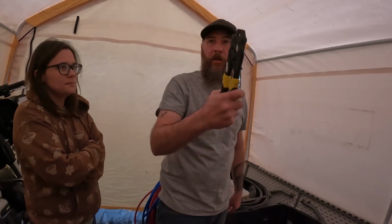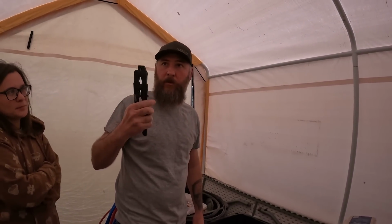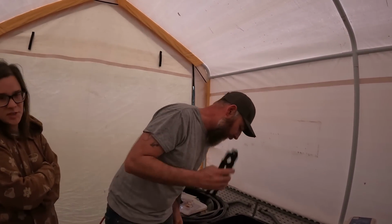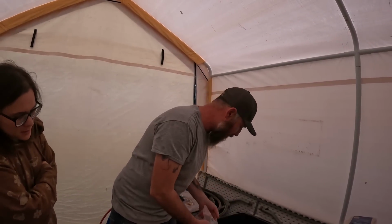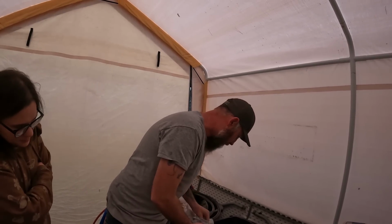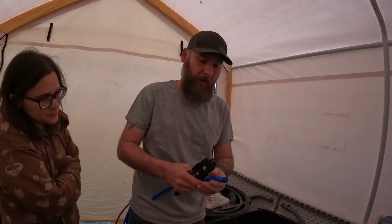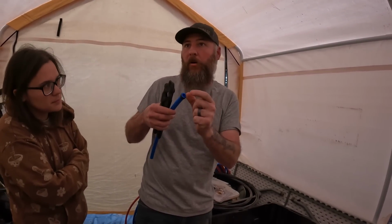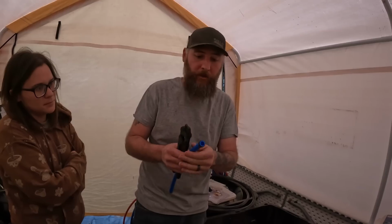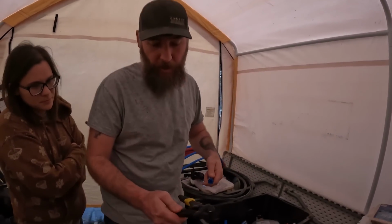This is when you use this tool. This tool is to cut the rings because you mess up. Trust me, I thought I didn't need this thing, but I did. So if a ring's crimped on, here's your fitting. You're like, man, I really need this elbow. It's the last one I got. Cut it off. So here's the fitting, and then this is a little slider.